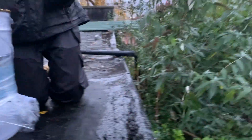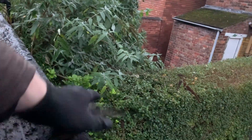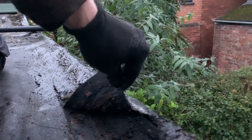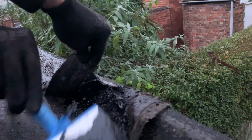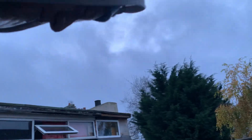Give that one wipe with a towel — just dry it where I'm going. So this is the culprit for the holes earlier: old shingly kind of roofing material. Gonna get some goop under there. We found pure holes through this stuff and what's left of it — we're just shlooping underneath, and then we're going to shloop over. Then we have some new material that we will dress over top and shloop again.